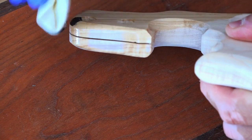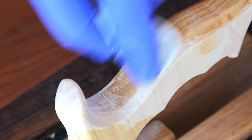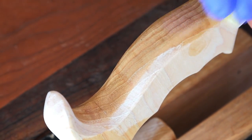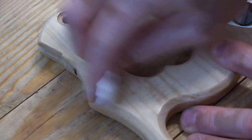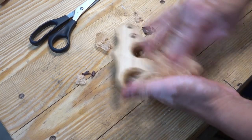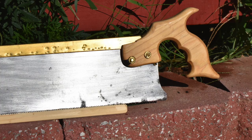For the finishing, I sanded the handle to about 320 grit and added a couple of coats of linseed oil. Once it was all dried I finished it with some furniture wax and it was ready to go. I hope you enjoyed this project — I think if you try to do it yourself you're going to save at least a couple hundred dollars for a saw like this. Thanks for stopping by and hope to see you again next time.